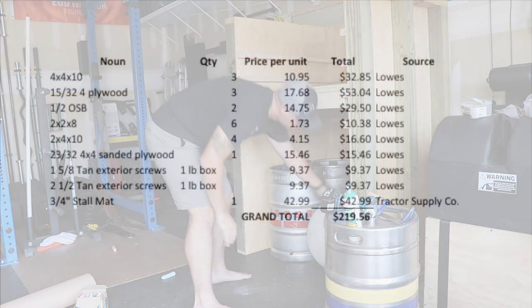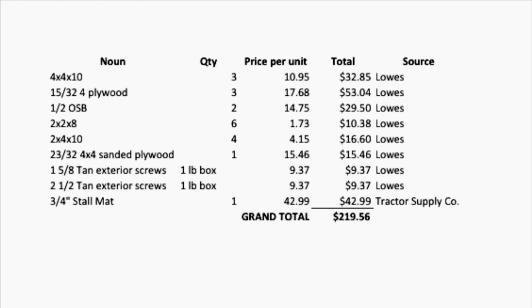Here's the final cost — most everything for this build came from Lowe's and prices are direct from my receipt. This includes two 4x8 half-inch OSB sheets: one for the very bottom layer of the platform and one for the very top layer underneath the rubber stall mat, with the wall cutoffs as the middle sandwich layer. I moved the platform out of the way, checked the floor after a few drops, and everything was good to go. That's the build — it was relatively easy, just took a little time. I hope you enjoyed the video; if you did, subscribe, and hopefully there'll be more of these to come.